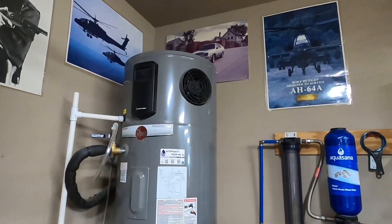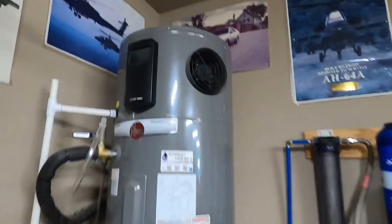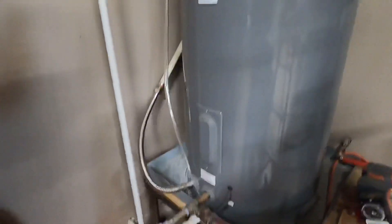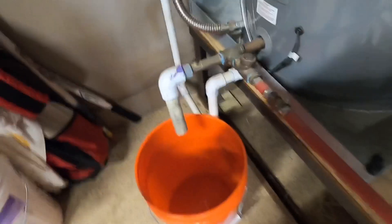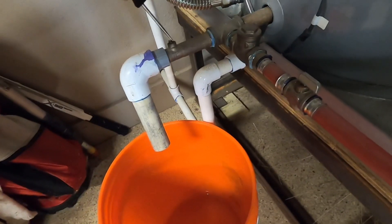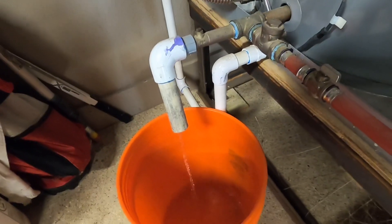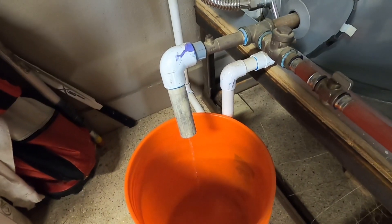So I've got a fix for that, and I'll show you how I do it. The first thing I've got to do is come up to my shutoff valve for that water heater and turn it off so there's no pressure coming in. Then down at the base of the water heater, you've got your drain. I've added some PVC here to direct the water down, and I just take a five-gallon bucket, open up the drain, and you'll see it spits out some water.